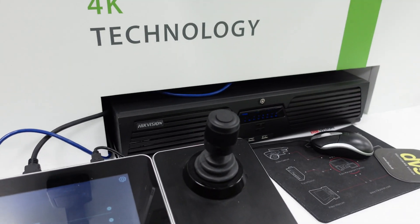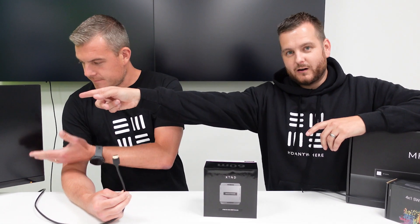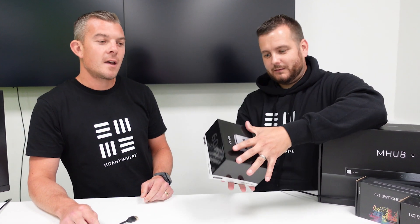This is a 3-meter HDMI cable, 4K. And we're going to use an HDMI cable from that monitor, and in between we're going to use the extender — 60 meter, 2K60. We've already set the output of the NVR to 1080p, so that's really important. If you've got it set to 4K, make sure it's set to 1080p.